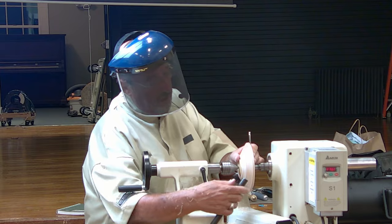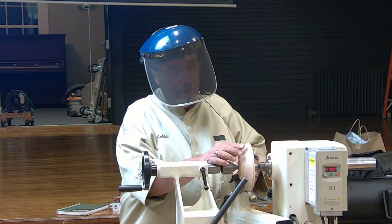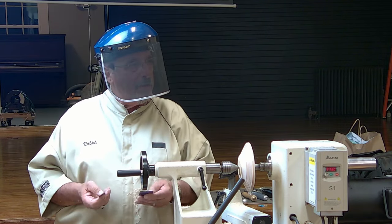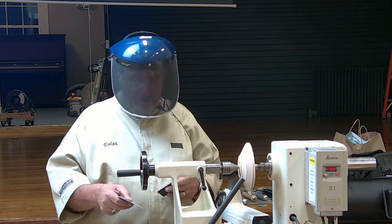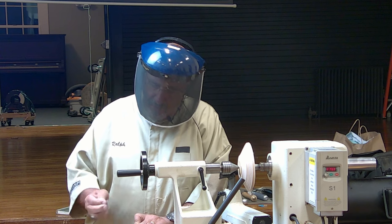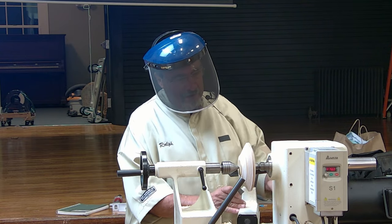That's really pretty much it for the outside. What you can do if you want — which I very rarely do — is sand this with 320 to 400 grit, folding it in half and doing the inside of the bead. Anybody know how I burn in between the beads? It's a high-tech tool: Formica. Go to Home Depot or Lowe's, grab a bunch of Formica countertop samples, come home, cut them up. It's a little bit too thick to get in between there, so take a piece of 120 grit and just sand it down a little bit. I do the shiny side so I know when I get rid of the pattern, it's thin enough to burn.